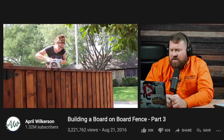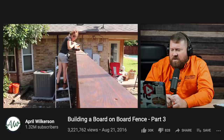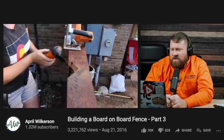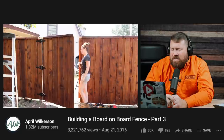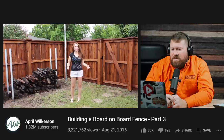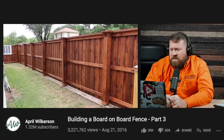Almost done. At this point the gate was still just one solid wall, so April moved to the top with a circular saw and made one diagonal cut to break it loose. Even with that cut done, the gate still wouldn't open freely because the top cap interfered, so two relief cuts on the hinge side were made to give it the ability to swing all the way open — using a circular saw to cut the bulk of the material and a multi-tool to cut out the remainder. The gate should now open freely. It's a sigh of relief — project complete! The steps are not technically difficult; it's just the sheer size of the project. Schedule it out so you can take your time and not get overwhelmed.